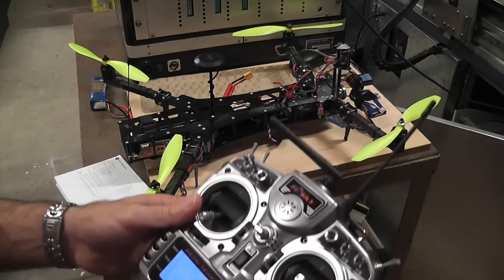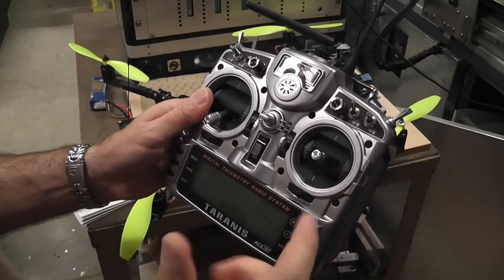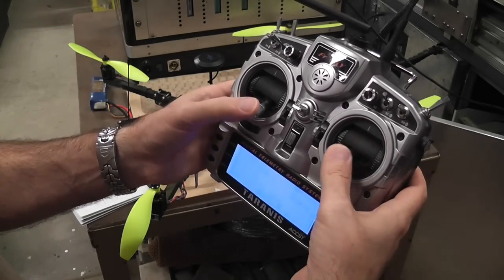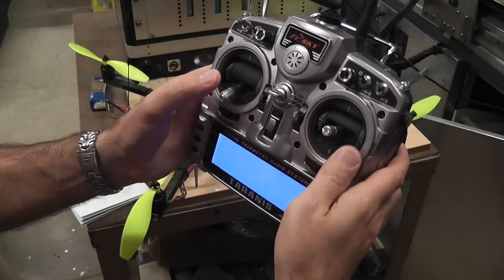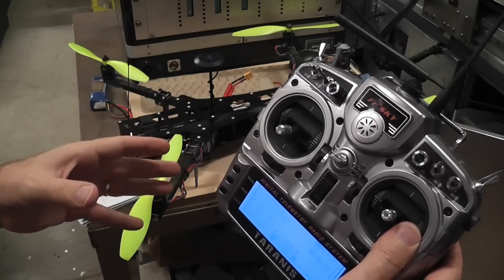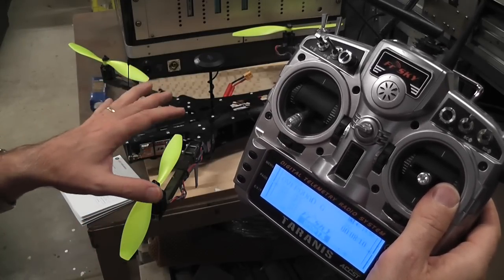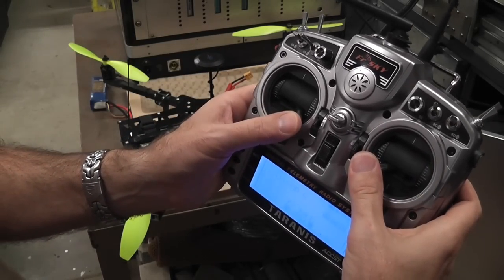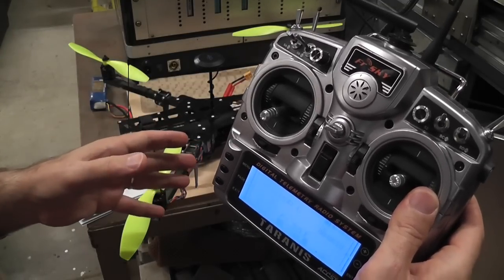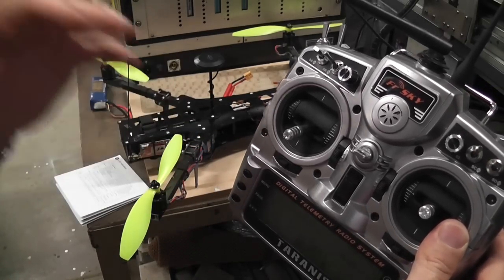Just to finish up, I wanted to mention a couple of things. There are two ways to power up the motors from a start position. First, it has to be in manual mode - in my case that's with my switch all the way up. You can start the motors by toeing in or toeing out, either will start them. If you don't accelerate within the first three seconds, the motors stop. Also, as discussed in the forums and something I've noticed, if you bring the throttle all the way back to idle it actually switches the motors off - which is a problem in flight. You'd have to quickly toe in or toe out to get the motors back up and throttle up again. The forums mentioned using throttle curves so it doesn't go all the way down to flight idle on your controller, which is something I'm going to look at.